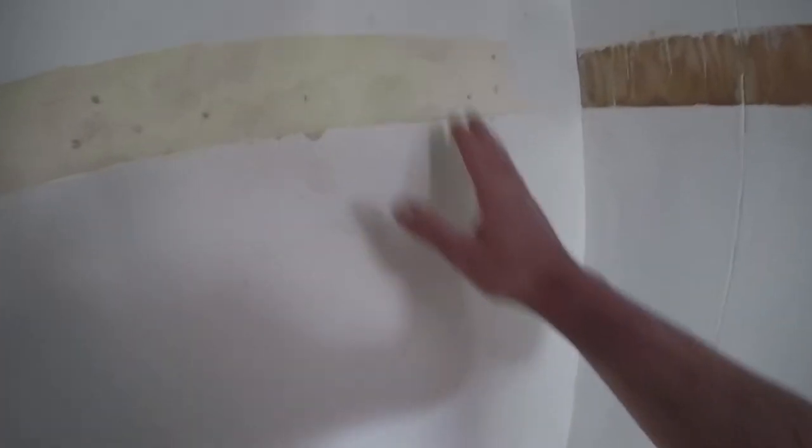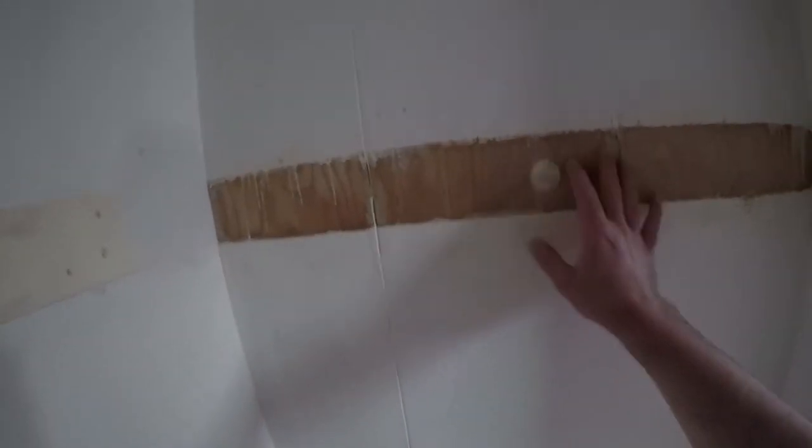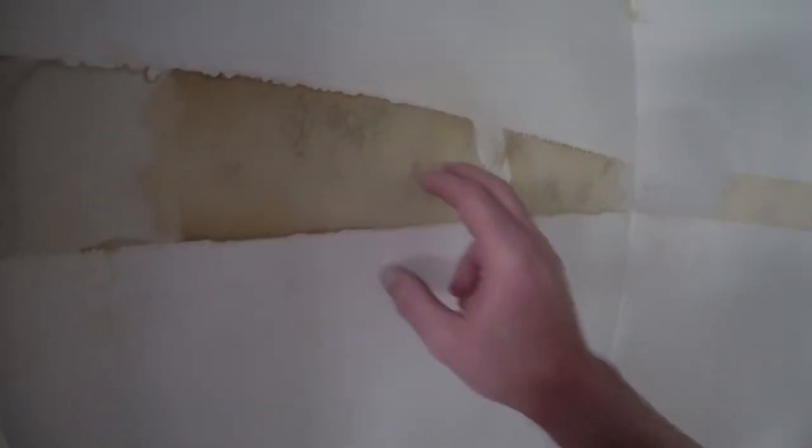The walls are all now wiped down and about ready to start painting. I'm just going to do a first coat that only hits these relatively unpainted areas. That way when I do the top coats, I'll have a more even base and you won't see the stripes showing through. By doing only these areas that need the first coat, I'm going to save myself about two to three coats on the top coat.